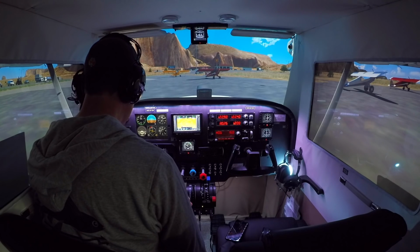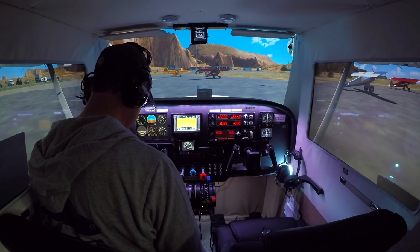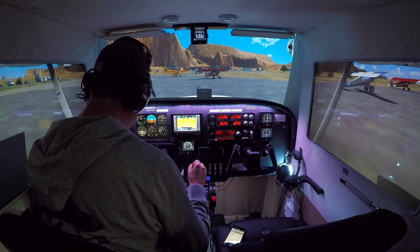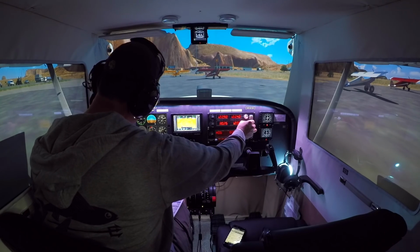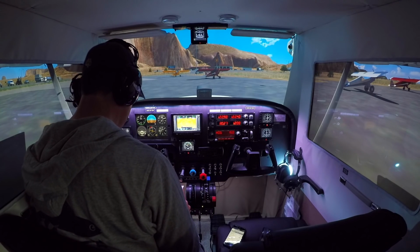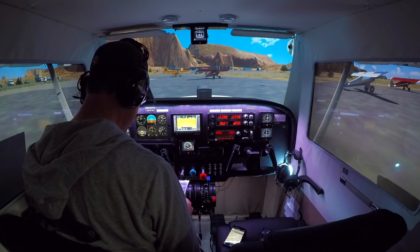So what we'll do is we'll set our altimeter based on what we know the altitude of the field to be, and the field's altitude is 5192, and it looks like we're just about right for that. In fact, we're just right for that. Maybe a little, there we go. And that means that our pattern altitude should be about 6,100, 6,200 feet.